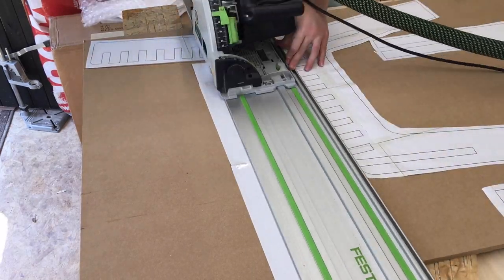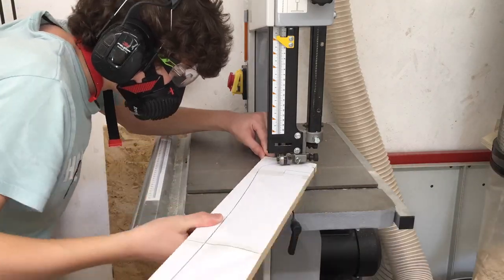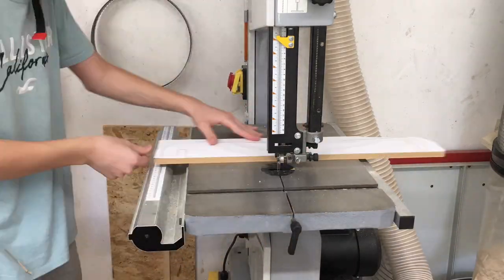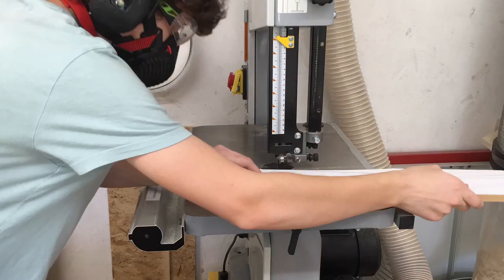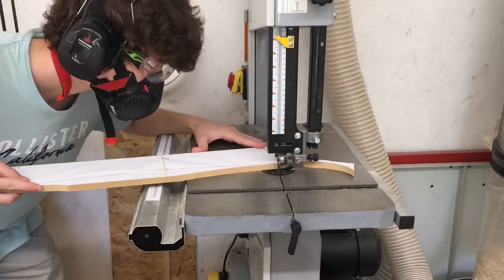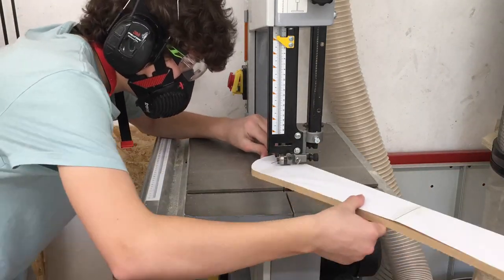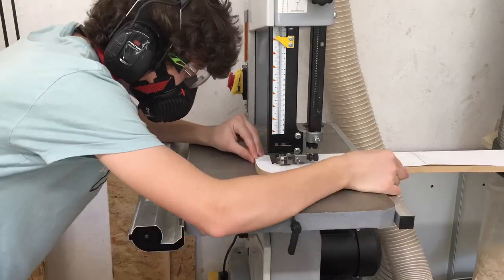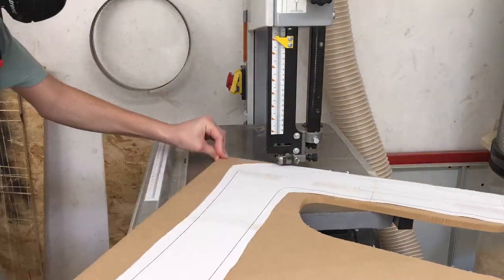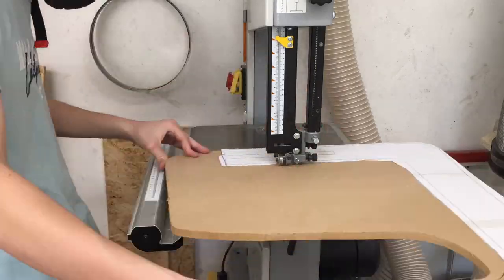This project consists mainly of repeated cuts, which is why I used templates — that allows me to make one template of each piece and then repeatedly flush cut them on the router table. I used quite a few machines for this project, including a bandsaw, track saw, and a random orbital sander.